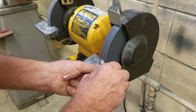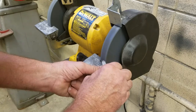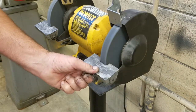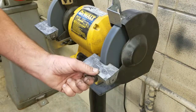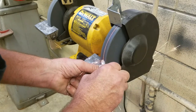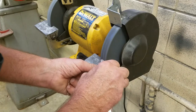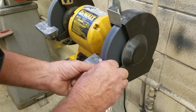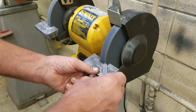Got to quench it quite a bit. In the last video I mentioned we're using some 5% cobalt tools which are not that great. You can get an M2 high-speed bit for about four dollars a piece. You can get 5%, 8%, or 10% cobalt — the more cobalt, the more heat the bit will take. We can go all the way up to M42, M43, and T15s, which are really nice but about $35 a piece, and I can't spend that when I have 20 or 30 students needing bits. I usually try to get cobalt on sale.